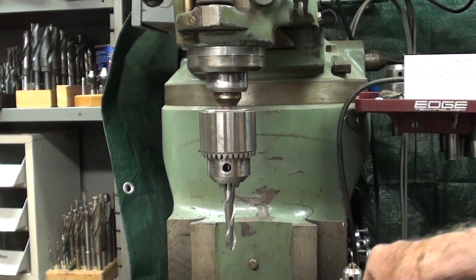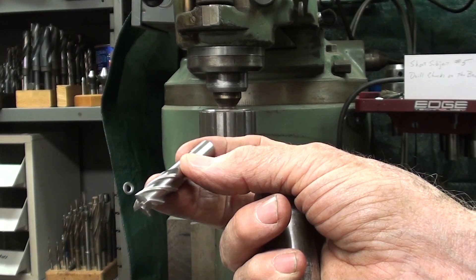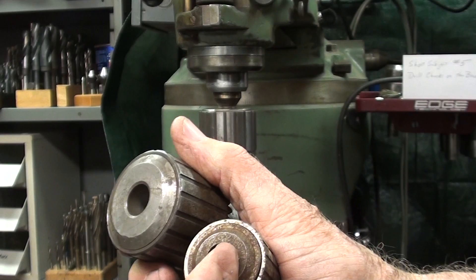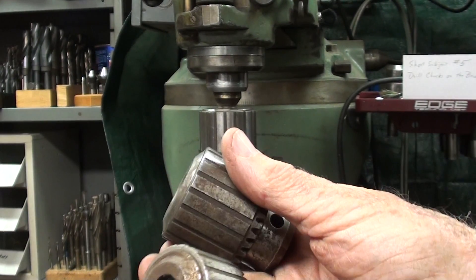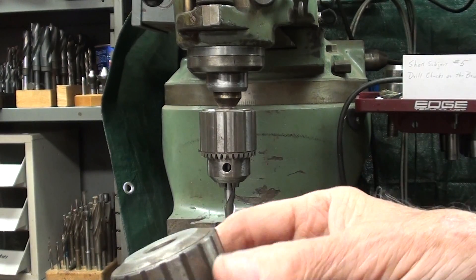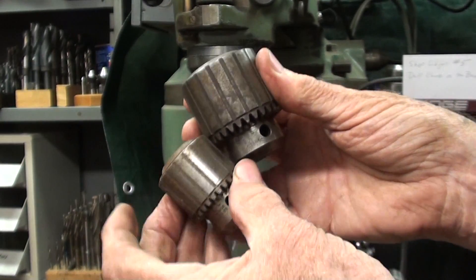That's kind of scary when that happens. When it hits the floor, it will probably either break the cutter off or certainly dull it, and it could hit somebody and cause serious bodily injury. Now, you can buy Jacobs chucks that have threads and use a threaded arbor as opposed to the taper, but these are typically made for portable drills, so that's probably not going to come up. I guarantee that these come loose — I had even tried using Loctite on them as a stopgap measure when I didn't have the right collets, and they'll still come out.